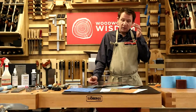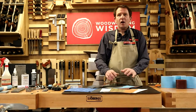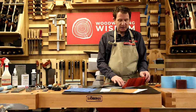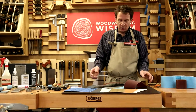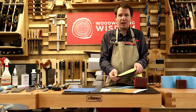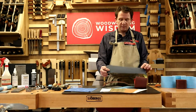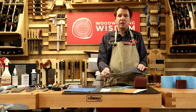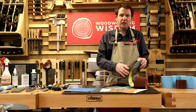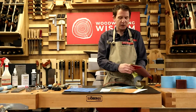Let's have a look at what we've got. First: what can we sharpen on? Abrasive paper - but that's a whole term of different things. Ideally, cloth-backed abrasive is better. Those of you who've been watching Colwyn's woodturning demos, we use this RB406 cloth-backed abrasive - stronger, designed actually for the metal industry. It's aluminium oxide, resin bonded onto a cloth backing. I prefer the cloth-backed as we go through.